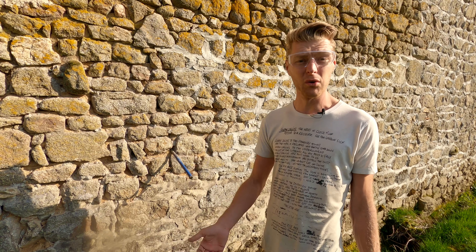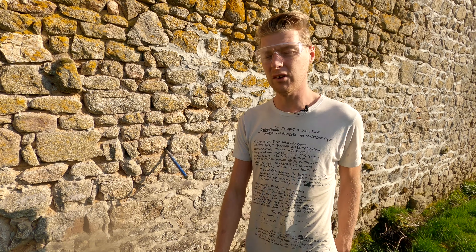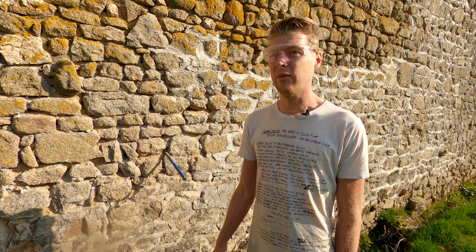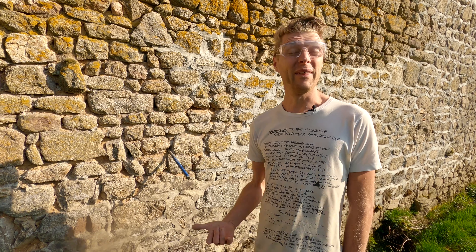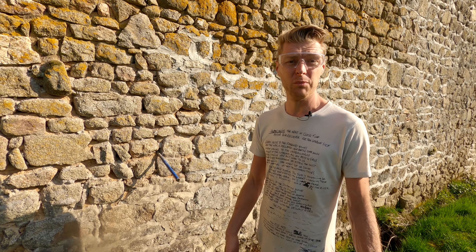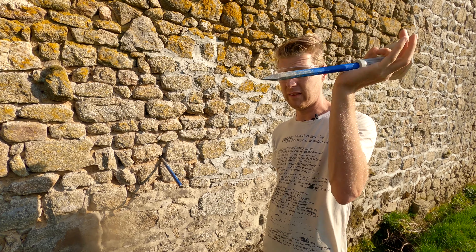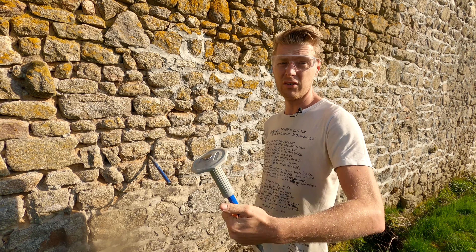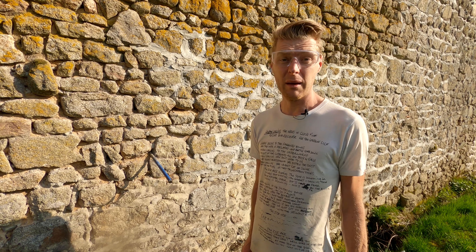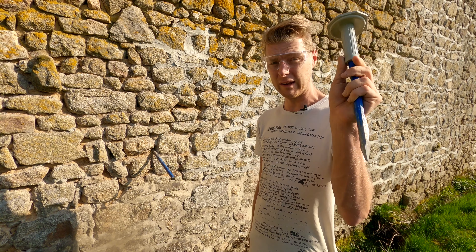So in this video, Meriem and I are going to talk you through the job of knocking all of this off and repointing it with nice stuff. Because there's a lot of people out there in the same situation as us. It's a very complex job — one of those jobs you've just got to take your time at. And you need a really good chisel; a really good long-arm chisel like this is vital. A short chisel will end up with you bleeding a lot — you'll miss the end of the chisel and knock your knuckles, trust me. At first I tried to get by with a century-old mason's chisel that I just happened to have, and it wasn't good enough, so I went out and spent the money, because these are not cheap.